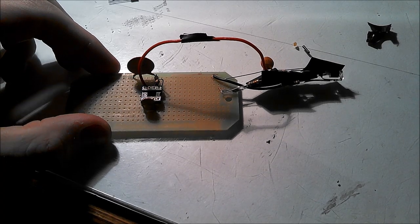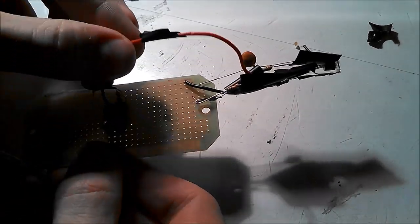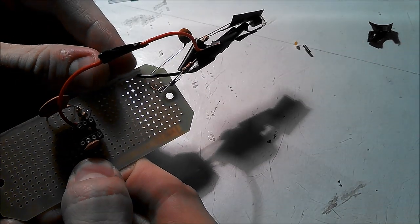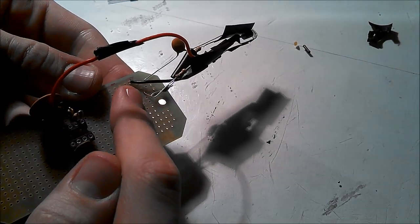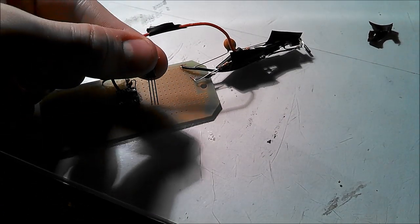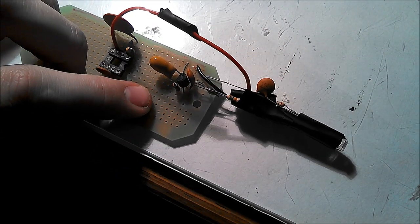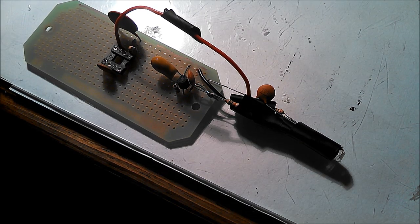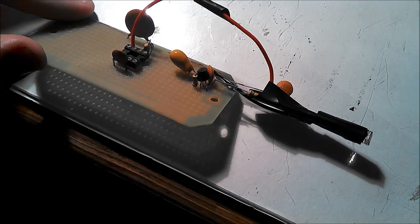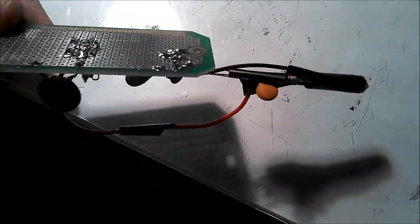Once you attach the photodiode circuit to the protoboard, it should look something like this. You should have four connections: one connection going to pin three, two connections going to ground — the capacitor being one of them — and one connection towards the top that will connect to the emitter of the transistor. Once you complete steps eighteen and nineteen, you should have the transistor soldered on with a 100UF capacitor, 100NF capacitor, and the 150K ohm resistor.